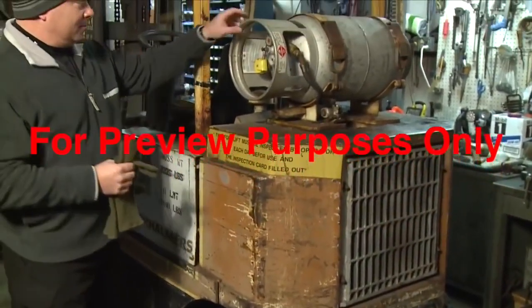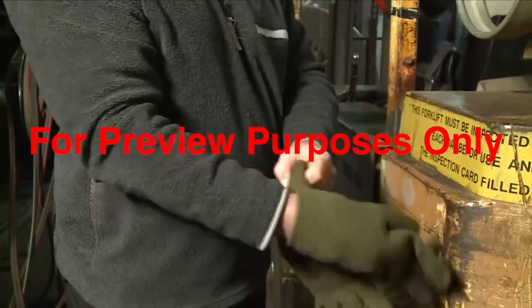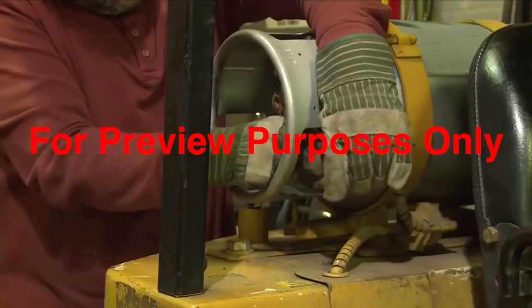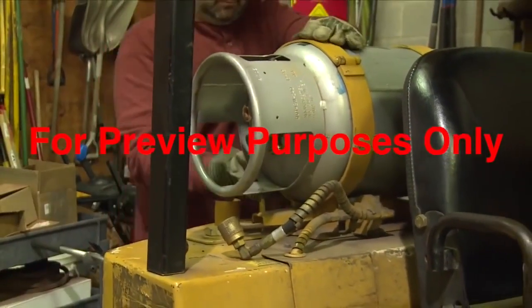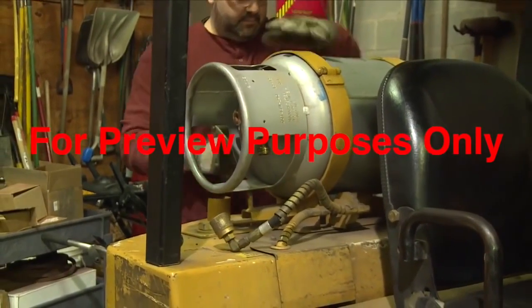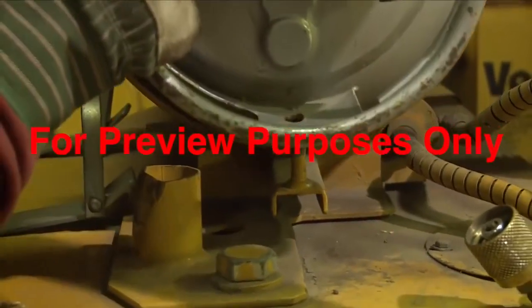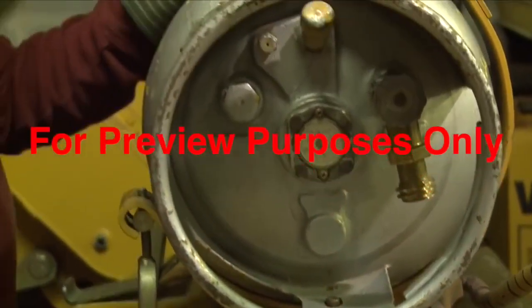Strangely enough, compressed gases, even flammable ones, can cause frostbite. So remember to wear protective gloves while working with them. Handle the tanks carefully. Do not use metal tools when disconnecting and reconnecting them. Always watch for signs of gas leaks in the system. When you put the new tank in place, make sure that it engages the locking pin on the forklift.